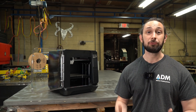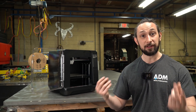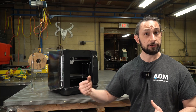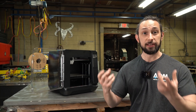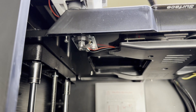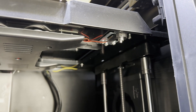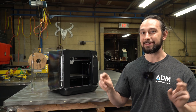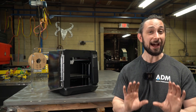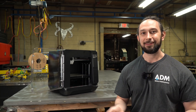The plate calibration was probably the most difficult, and one I'm still kind of working on to get right. It consists of three nuts that are underneath the platform, and what a lot of other reviews didn't quite understand or talk about was that there are three nuts situated underneath the platform, and underneath those three nuts there are three lock nuts. The lock nuts normally are kind of in a reverse thread to what the other nut is. Some reviews cite turning the actual lock nuts as the way to level the table — that's not the case at all. You can kind of turn those nuts and get a result, but that's only because you're backing one nut on top of another nut, and chaos ensues. Don't do that.